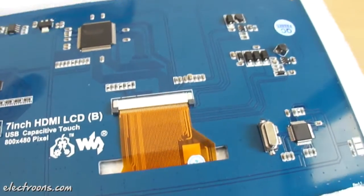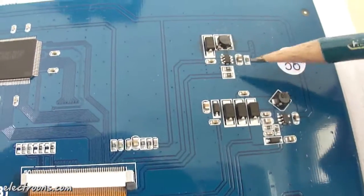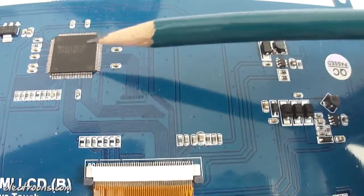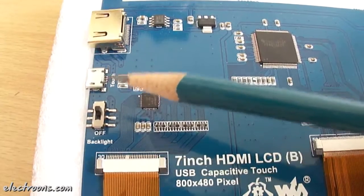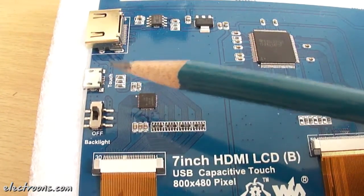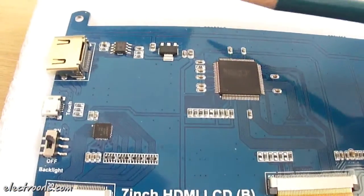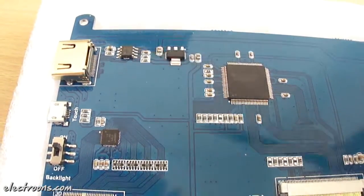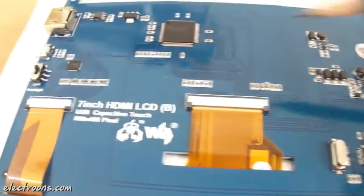That's all about the main circuitry. We also have power supply filtering circuitry with inductors, capacitors, and diodes supporting the display driver. An important point is that this LCD panel draws its power supply from the micro USB which is the touchscreen interface — so you must connect the touchscreen USB to power up the whole LCD panel. Apart from the 3 major ICs, there is an AMS1117 3.3V regulator and a small I2C EEPROM whose exact purpose I'm not certain of.